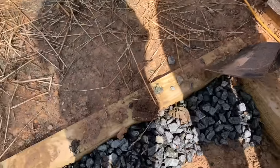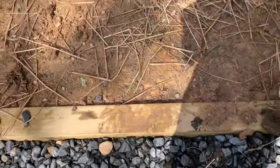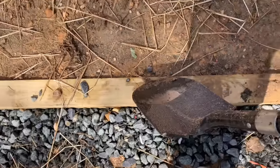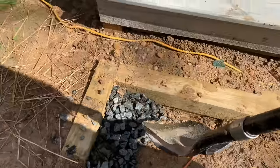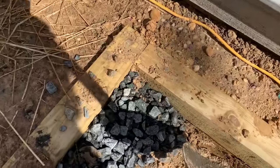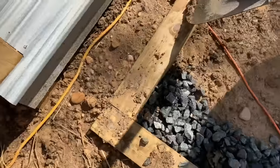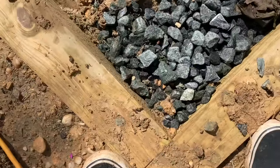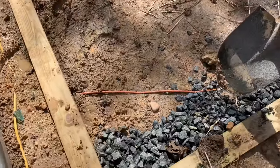The next design detail is the distance from the house, which is 46 inches, so that gives us exactly where this first 4x4 was laid out. Then we have a right angle here, and to make a right angle you can use the Pythagorean theorem. You remember x squared plus y squared equals c squared. There are lots of details online about whole-number right triangles.